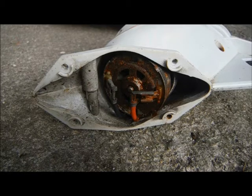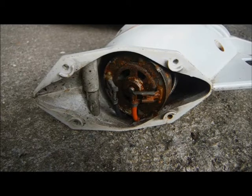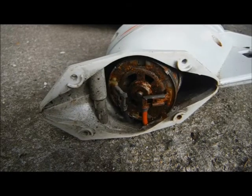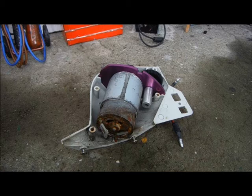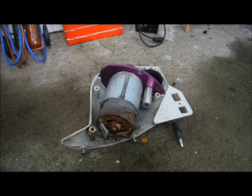I'm going to go flat out forwards. That's very slow. And now let's try backwards. So the problem seems to be with the motor, not with the flex drive. So I knew that I needed to replace this motor. I think it's just a usual silver can 550. I don't think it's a 540 because it looks quite long.